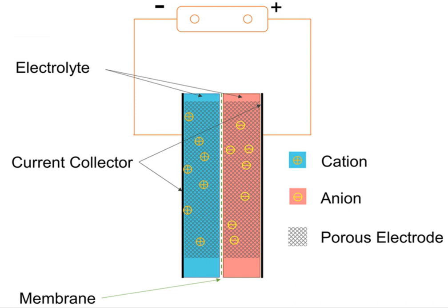Another way to enhance CNT electrodes is by doping with a pseudocapacitive dopant as in lithium-ion capacitors. In this case, the relatively small lithium atoms intercalate between the layers of carbon. The anode is made of lithium-doped carbon, which enables lower negative potential with a cathode made of activated carbon. This results in a larger voltage of 3.8 to 4 volts that prevents electrolyte oxidation. As of 2007 they had achieved capacitance of 550 F per gram, and reached a specific energy of up to 14 Wh per kilogram, 50.4 kJ per kilogram.